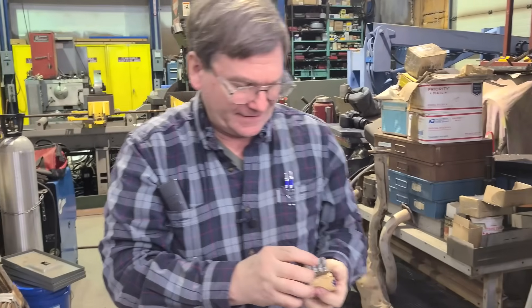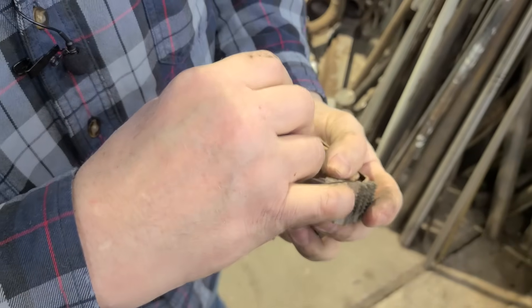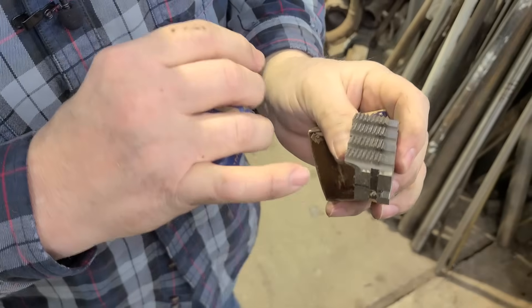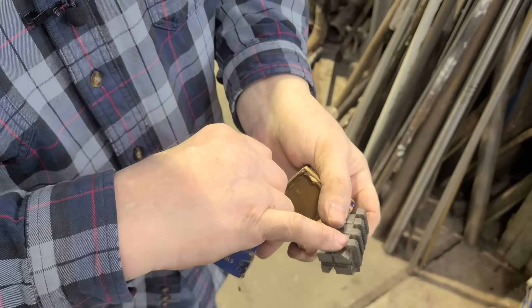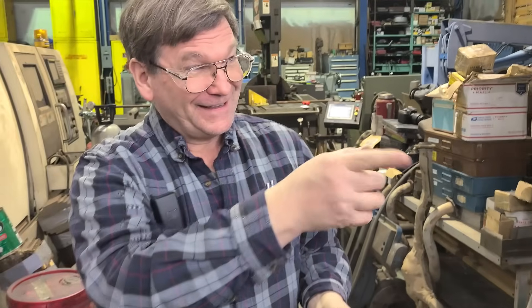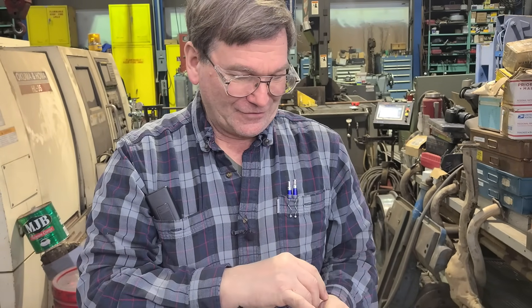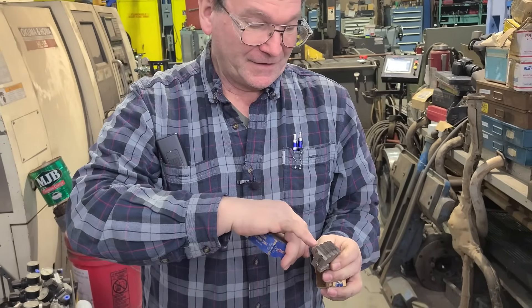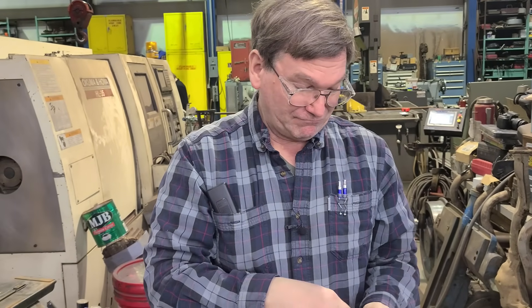Here are ones that are at least big enough to see. All of this is sharp teeth with a little bit of a chamfer. As these dull, since the cutting happens at the front of it, you just keep sharpening it back — you grind this back. Where I used to run a lot of turret lathes, we just used a standard everyday carbide grinder with a white wheel on it for grinding high-speed steel, with little stops clamped on. You just grind the front down at a relief angle, set your table at the angle you want, and hand grind it back and forth. It's not that hard to sharpen them.